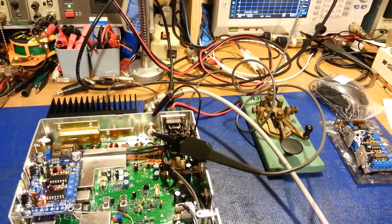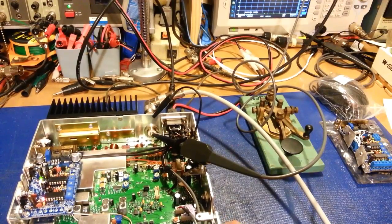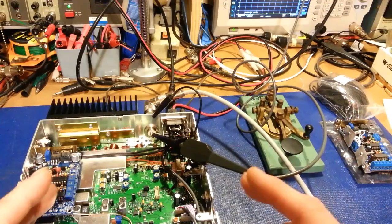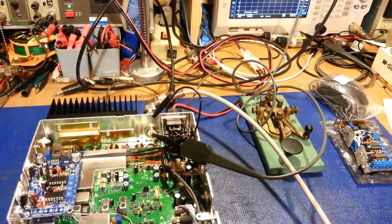And then the 1/4-inch jack is actually your audio input. So ideally, and he explains that on the website, you should be running a rack system, because if you use the mic jack on the front of the radio, your audio is being run through the radio, so it's already been processed, bandwidth narrowed, whatnot, and the whole idea behind these boards is to turn your radio into a broadband RF spectrum splatterbox, which is basically what it does.